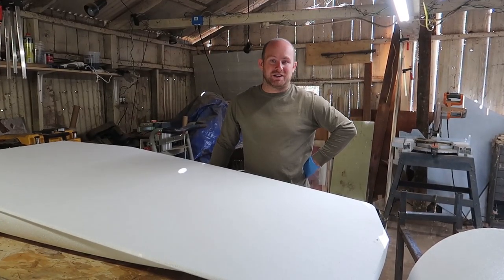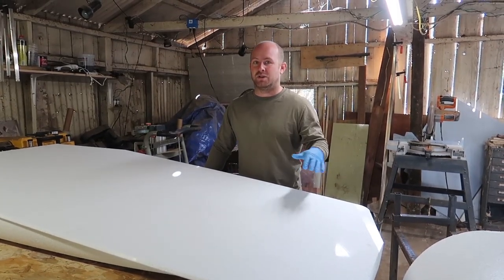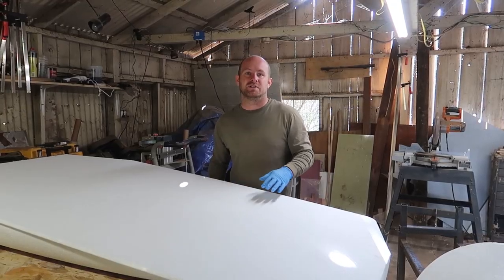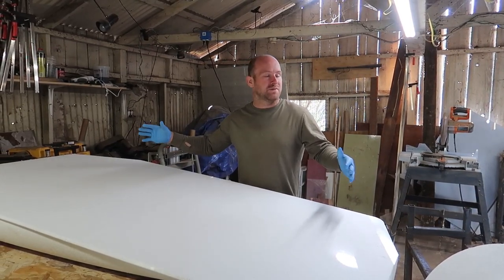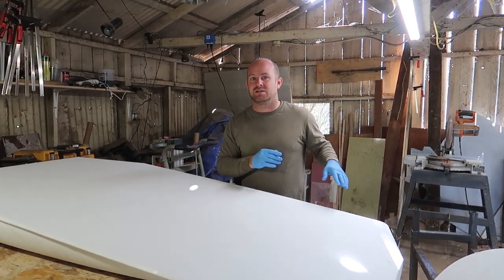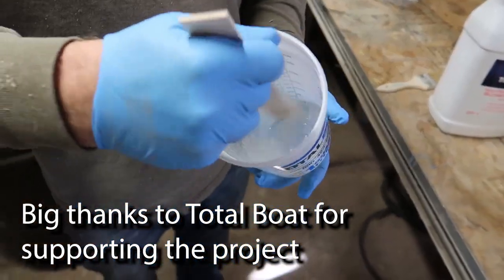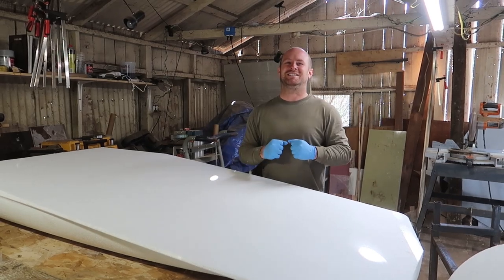After cleaning the barn, I think it's time to start gluing up the styrofoam. I'm going to use Total Boat slow hardener to glue the styrofoam together — basically just slather on a thin paste, lay the two pieces together, and let it sit for a day or two. I'm going to do them in thirds, the way the foam was cut, then glue those thirds together and mount it all on a stand. Kind of nervous — I've never done any of this before and I don't want to mess it up because it was almost two thousand bucks to get the foam cut.